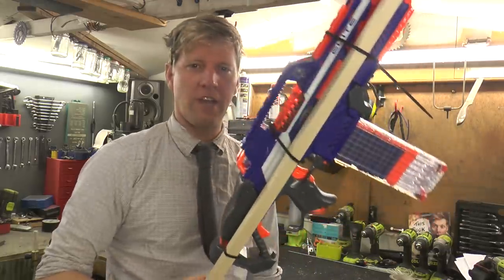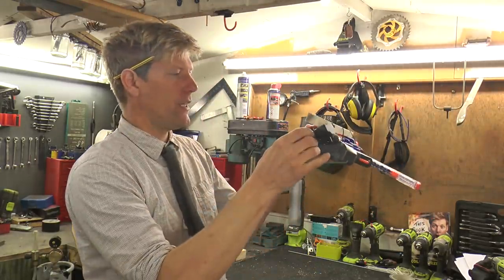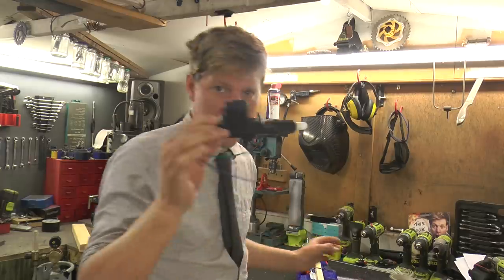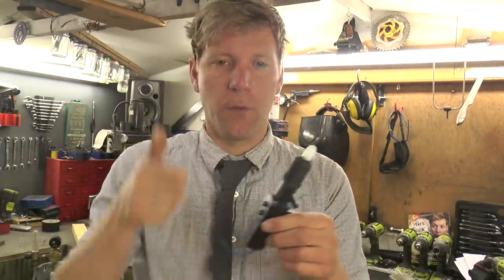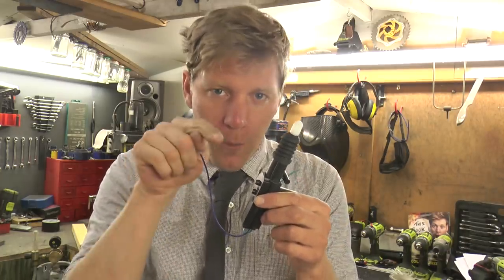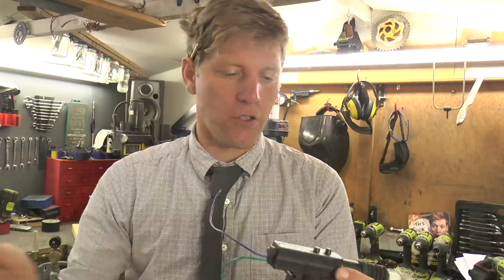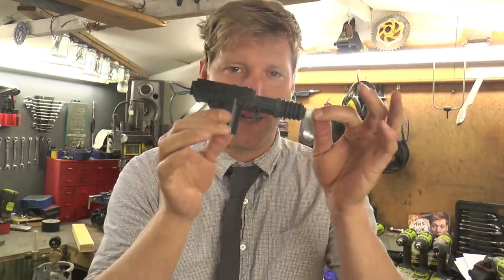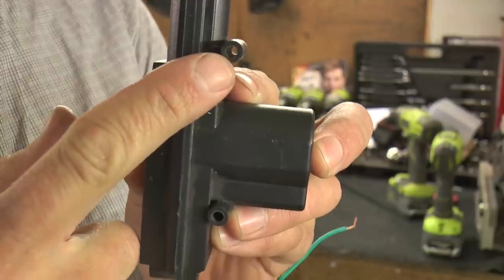That's got it attached on there, nice and solid. Now the next job is to attach our actuator to the end of the piece of wood. These actuators are actually off car central locking door systems — you know when you click your car to open it and the little tag pops up, it's one of these which does that. You can't just go to most local shops and buy these, but they are available online and very cheap. Now before we fix it, we just need to alter it slightly, because these holes in the side here are not quite big enough, so we're going to drill them out.